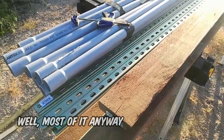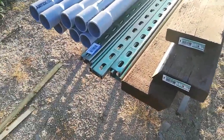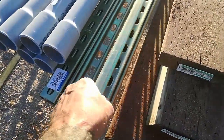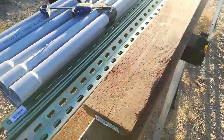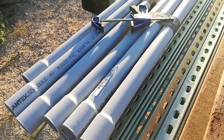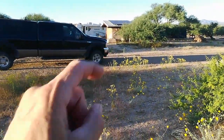This is the pile of stuff we're going to be using to make this ground mount. This is the unistrut I was talking about — picked it up at Home Depot. I wanted to get the deeper channel unistrut but it wasn't available, and since the solar panels are going to be bolted directly to the top it really doesn't matter how deep it is. I've got six of those. These are the two-by-sixes, all already beveled. This is one-and-a-half-inch PVC for above and underground electrical installation, and I'm going to be trenching from this location over to the solar shed — about 75 feet.